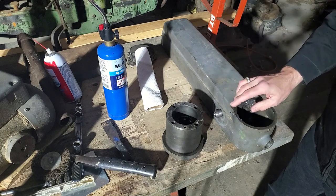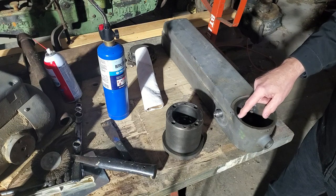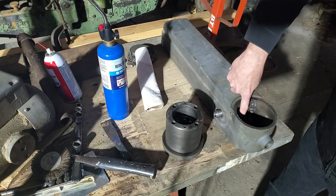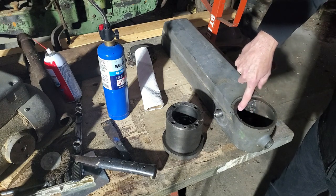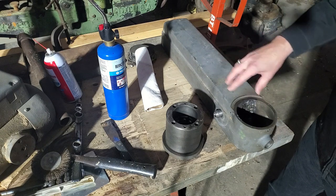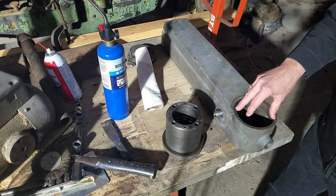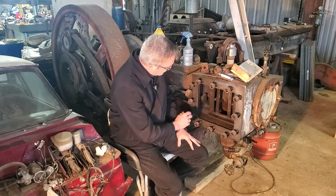And I've got to get a couple of cutters and a boring bar to be able to clean this up. I'll probably rough it with a roughing mill, and I'll orbit this to get that cut very close to the original bore. Then I'll switch to a boring bar and try to just take the protruding parts back to the original diameter. Okay, so back over here.